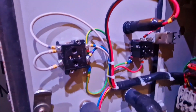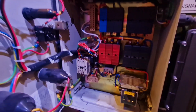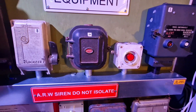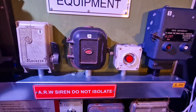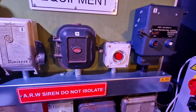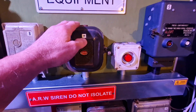On the back of the door we have the back of the key activation switches and the indicator lights. At the bottom of the plan it says WV1400 flood receiver, so that's how we know this one came off the flood network. One thing that wouldn't have been in the control panel is the thermostat for the heater plates at the end of the siren — that would have been in a little box up by the siren itself, either at the top of the pole or on top of the building.